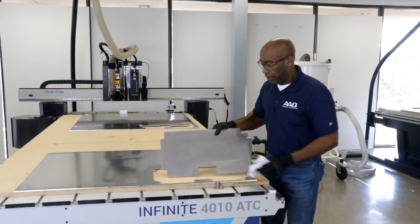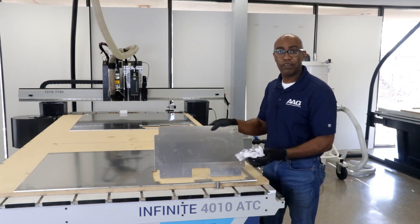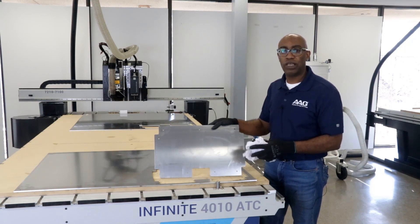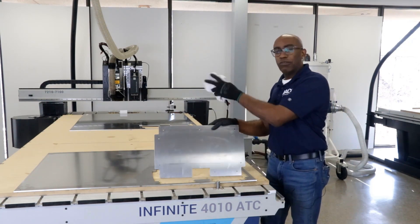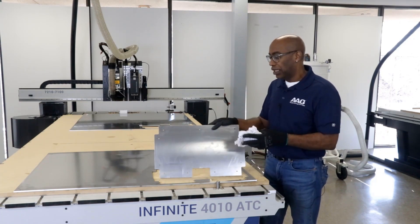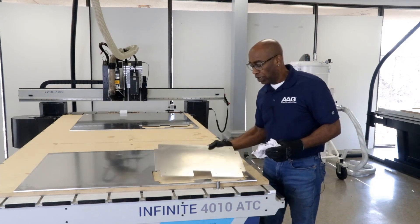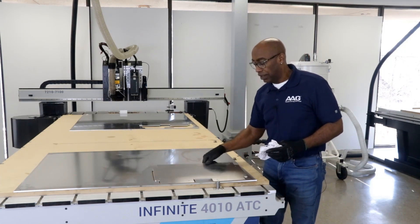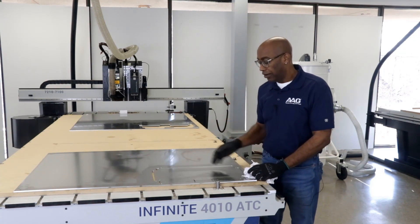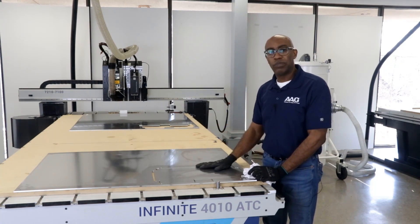If I was running a full nested job, I can just run the full nest, move to the back, cut the same nest in the back or a different nest. It doesn't have to be the same part in the front and the back — it can be a couple of different NC files you're running. I can have 20 different nests, run 10 in the front and 10 in the back. Pendulum gives you the ability to run a lot of production on a continuous basis. Cutting with aluminum, we had no issues — good edge quality, good chip collection, and very little residue using our cut fluid. That's our basic process for cutting aluminum plate.